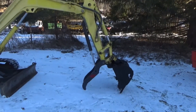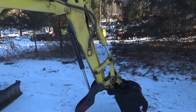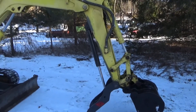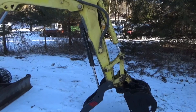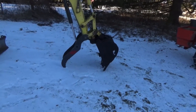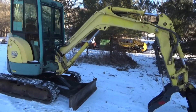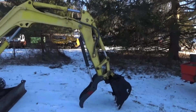Here's a shot outside where you can see it a little better. We measured all the fittings for the hoses and I'll order those. It's BSP on the excavator, and the cylinder has STOR fittings — an o-ring on the outside with a flange. But that's essentially what it's supposed to look like when you're picking up stuff. Once we get those hoses on we'll do a video using it — if we get some warmer weather; it's pretty cold here in New York State right now. Okay, that's part one.